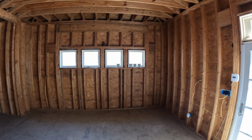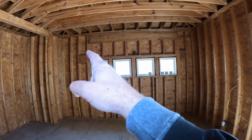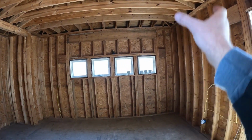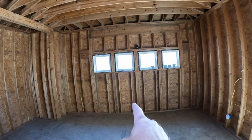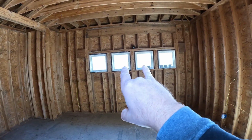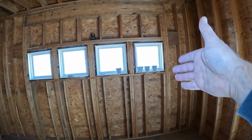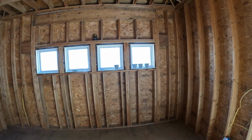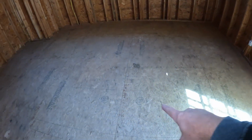All right, so we got in here and we kind of laid out the kitchen roughly on the floor. Wall-to-wall cabinets, going to have a refrigerator on each side. We'll have a 48-inch range in the middle. We'll have to omit these two windows. These two outside ones we'll have to take out and resize, put some vertical fixed casements or some sort of fixed window in there.